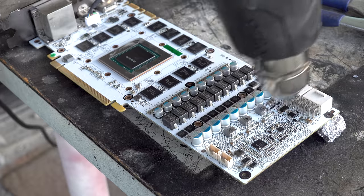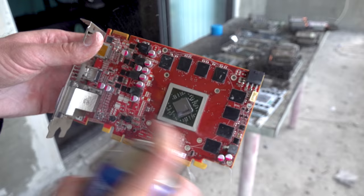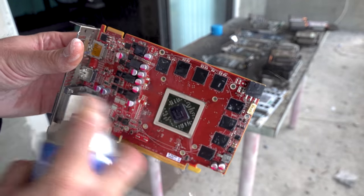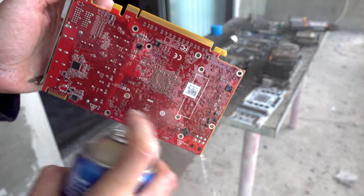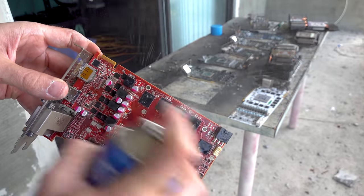And in part it's thanks to these right here, these chemicals. So of course we've got the brake cleaner. That's the quick and effective method for just getting all dirt and grime off really dirty parts, but also getting into areas where, say for instance, a USB port is clogged up and you just don't have the right tools to clean that out, like a very small brush with a thin bristle. This will just get it all out easy, done and dusted.